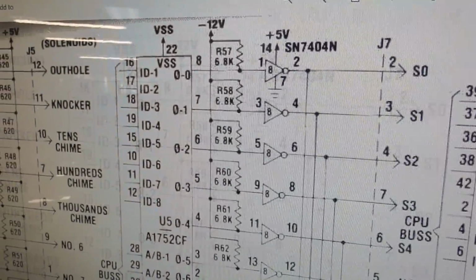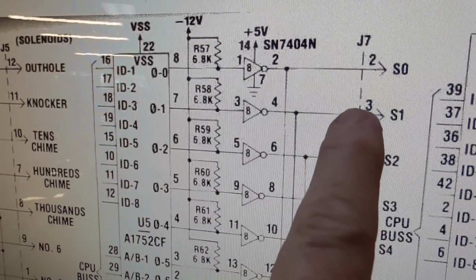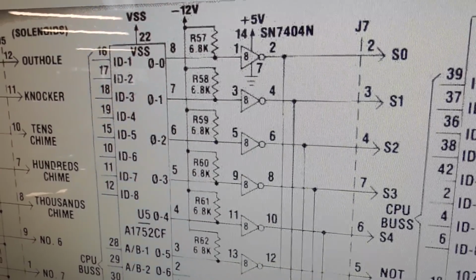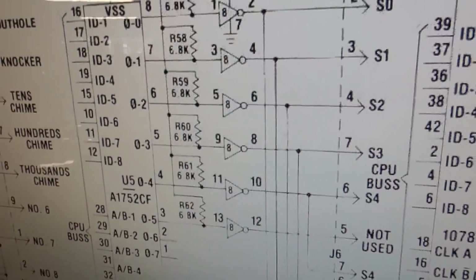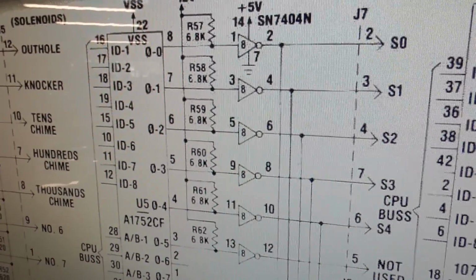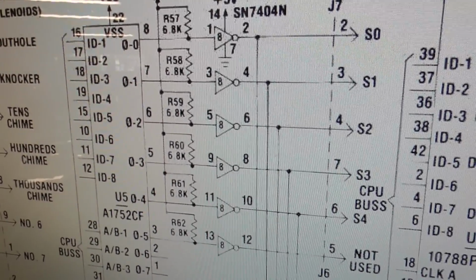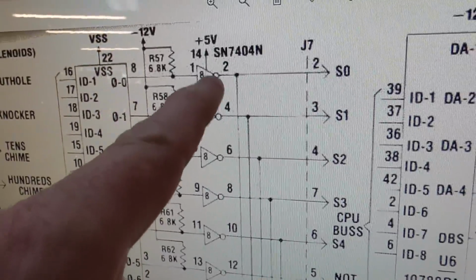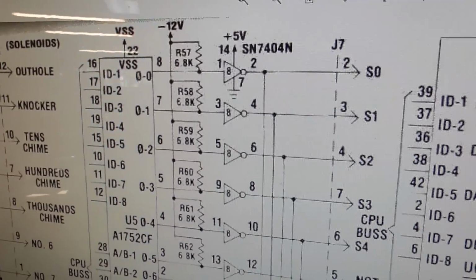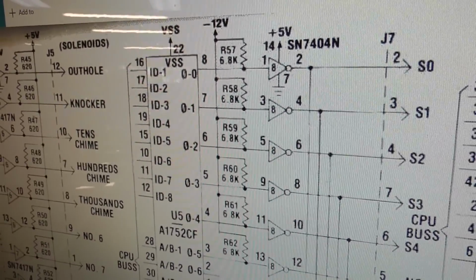Okay, folks, so I looked in the game, and unfortunately, this pin is definitely connected to pin 2 on the IC, as well as the other one. And then I checked to make sure that the wiring in the cabinet was all connected back to there, and it is. And then I checked all the diodes on all the switches, and they're all cool too. And remember, this chip is new. Uh-oh. So this isn't working, and this chip's fine. Oh, God! It might be the spider chip. Oh, no.